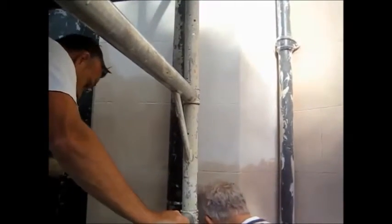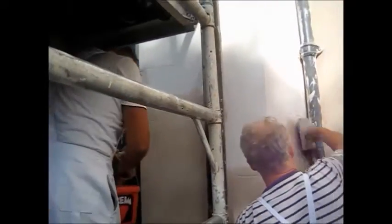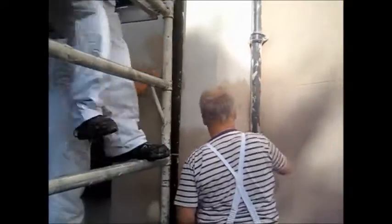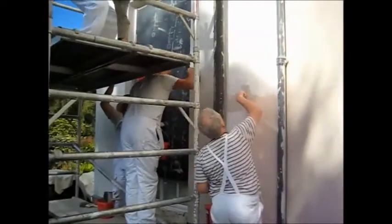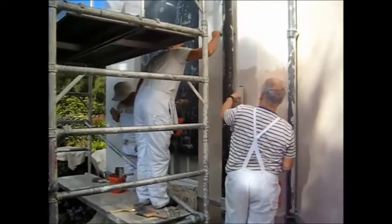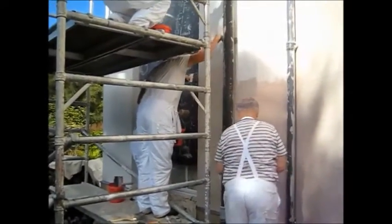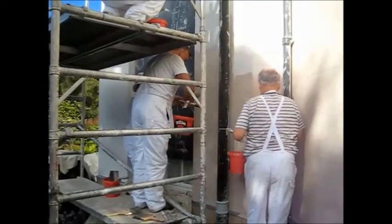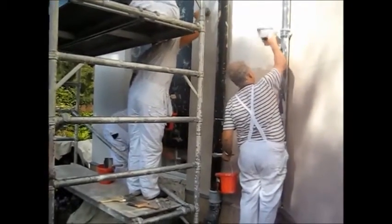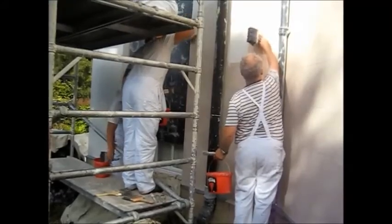The break point for this will be into a corner, not on an obtuse corner — into an angle. It's always working from the base upwards, otherwise a run will come all the way down the building. It won't have had its 12 hours to bond in, and when you come down to it you'll lift it off and have a negative run. Working upwards, if you drop any paint or it runs, it'll run back into wet material and you can just work it in or stipple it in.